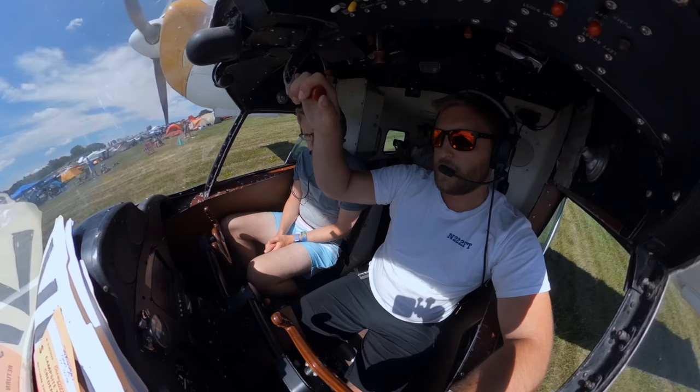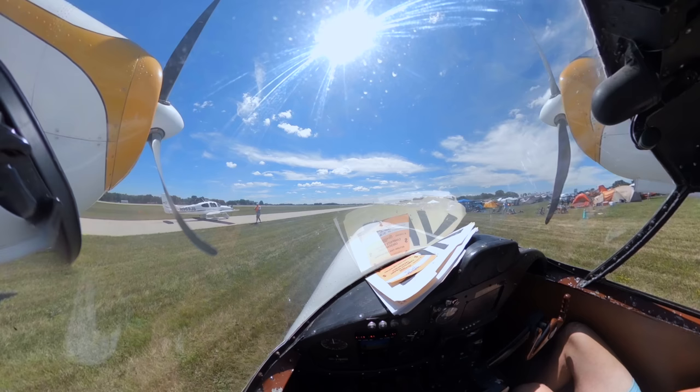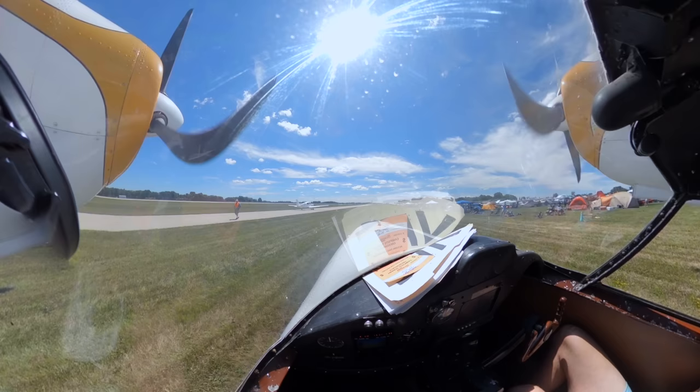These are geared engines, so they're a little bit different. We idle at about 1,200 instead of a thousand, and the reason is we're trying to avoid gearbox chatter, so they run a little bit faster. They scream on takeoff — they do about 3,400 RPM on takeoff. The prop's not quite doing that, but there's a little bit of difference in technique and you're always worried about loading the props.